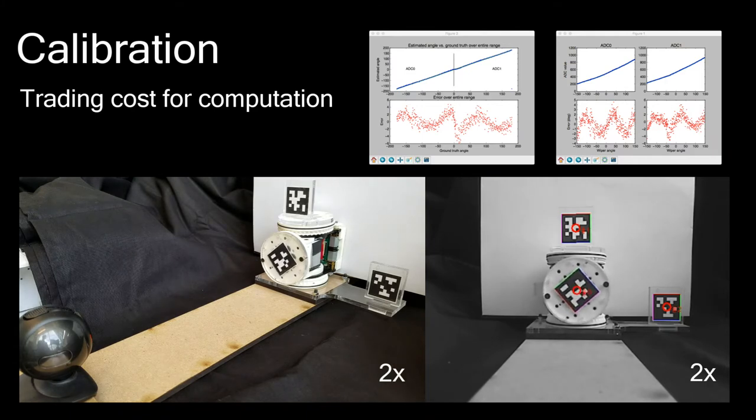Our low-cost manufacturing method produces potentiometers that are not necessarily uniform or linear. By using a calibration procedure, we achieve position sensing accuracy of 2%, which is comparable to many commercial potentiometers of similar or greater cost. Our calibration procedure uses April tags to provide a ground truth, making it low cost and adaptable to new applications.